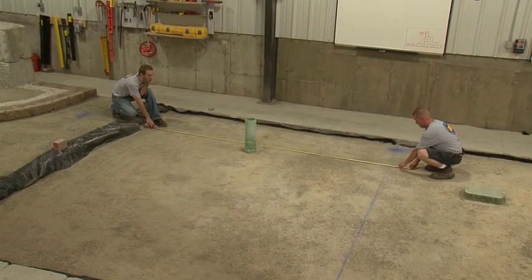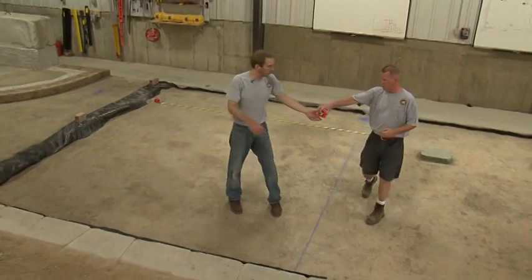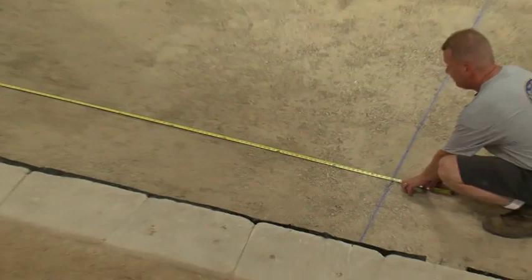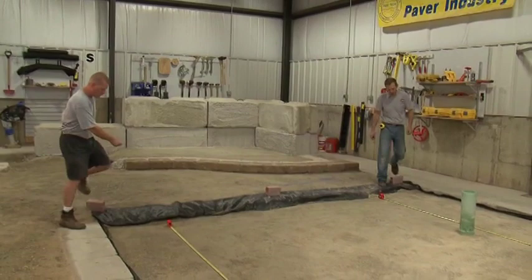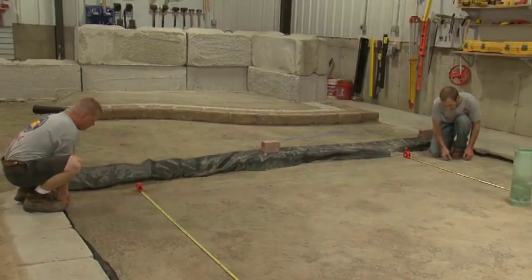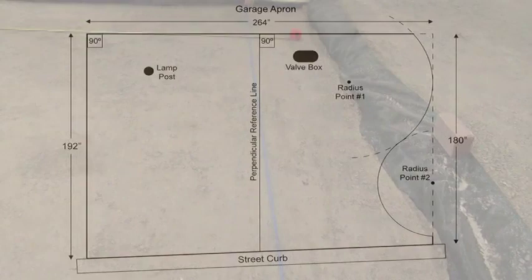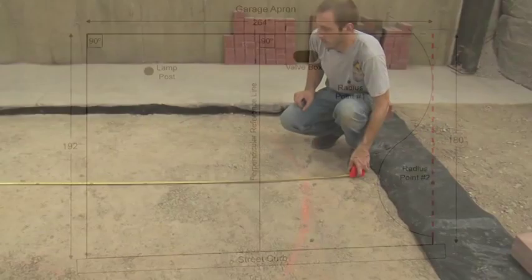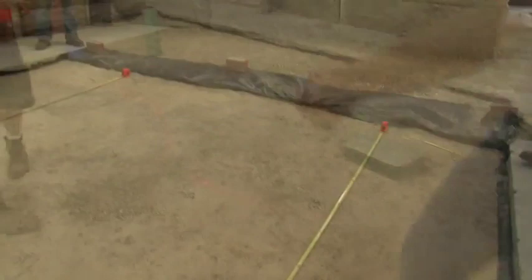Visually, what we're looking for is we want to stay perpendicular to our center line with the tape measure. We want to do this twice, again starting at the 12 inch point, visually checking to make sure we're perpendicular. We'll go ahead and lock the tape measure at 142 and three quarters.